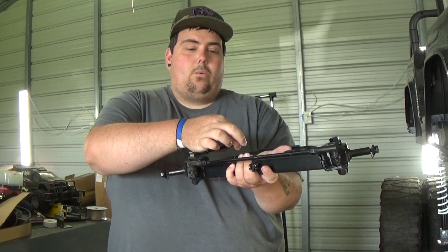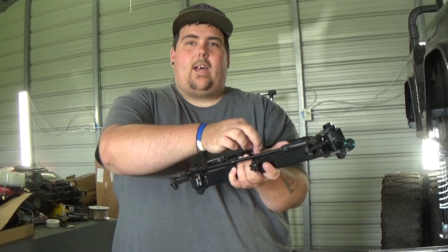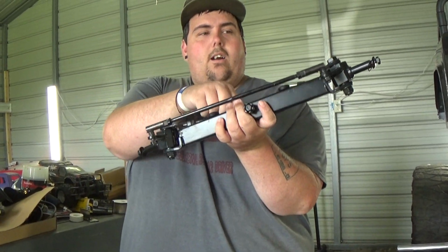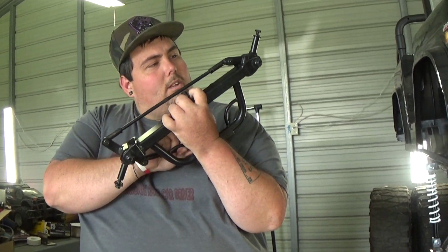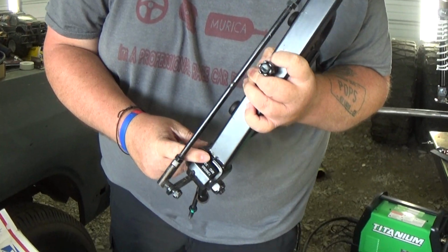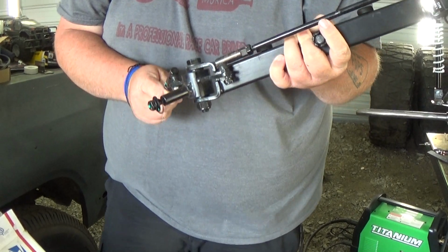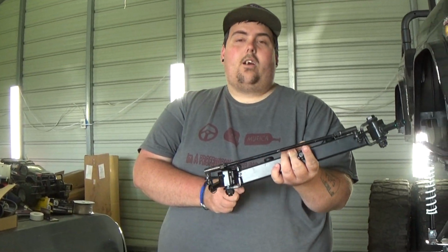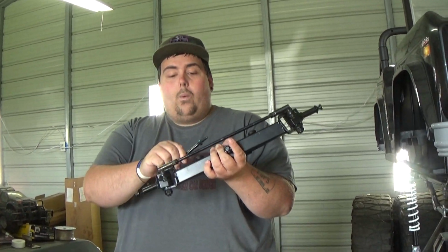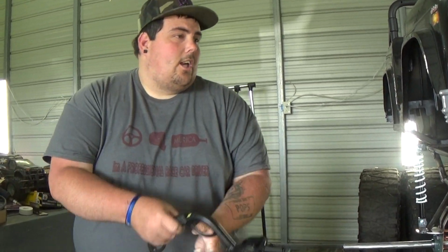so basically it would steer it or something like that. Almost kind of like a servo on RC, if you know about that. Have it so it turns, and it has stops on it, to be honest. Like right there is a stop, so it is cut out so it stops. So it turns pretty good. We just don't want it to turn too sharp. So if we have to weld stops to it, we can, or however far the motor turns.